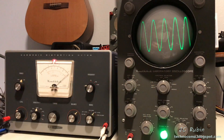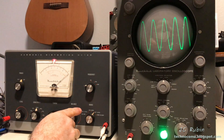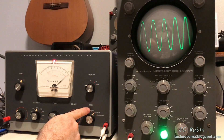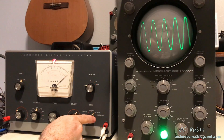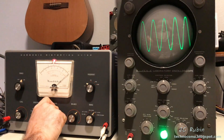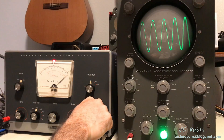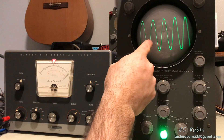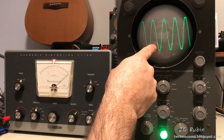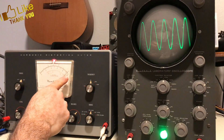I found the horizontal was fine. I'll bring my vertical back to where it was. 2000 Hz is an interesting frequency because one range goes from 200 to 2000, and the next range goes from 2000 to 20,000. I'm going to get the knob to the middle before I begin, just to illustrate this. Now I'm going to turn the filter on — watch what happens, because just by bringing this into circuit we'll null out at least part of that signal. Yes — very little — and we can see that the needle dropped ever so slightly.